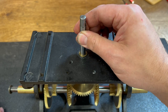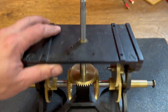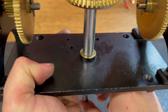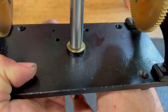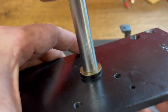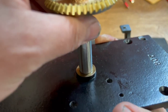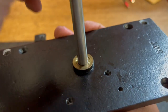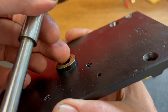Here's something I've discovered that probably needs attention. This has a lot of vertical slop, and remember that this actually runs upside down. If I turn the movement over, you can see this shaft actually rides on this bushing but it sticks and makes contact around the circumference of the shaft. We've got this steel shaft that carries the weight of the drive shaft, which is some eight feet long and hangs off of this. Over the last 120 years, I believe this has actually worn away into this brass bushing.